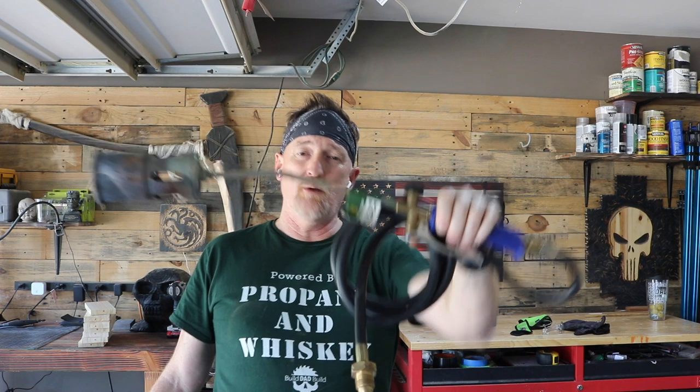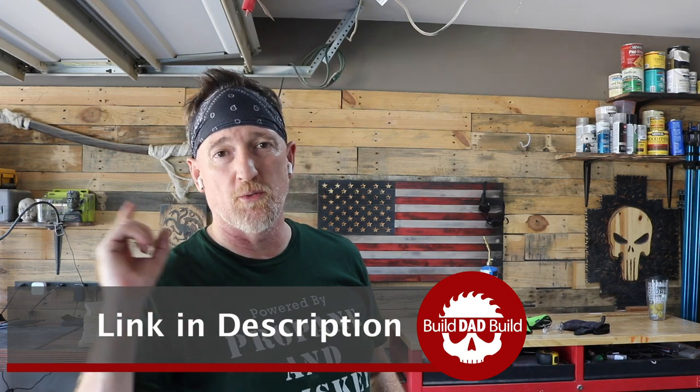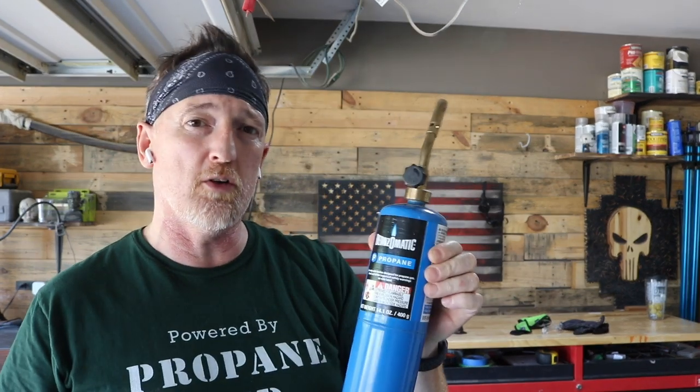And today, to do the burn, I'm gonna be using my big torch. I will link to a torch like this one in the description. I can't find this one anymore, but the one I'm gonna link to is the one that I wish I had. If you do not have a big torch, a small propane torch like this can work on smaller pieces. I mean, technically it can work on bigger pieces too, but you're gonna be there for a while. I found that you get a more consistent, even char with the big torch. That will come into play when we are brushing, which will be the next step.